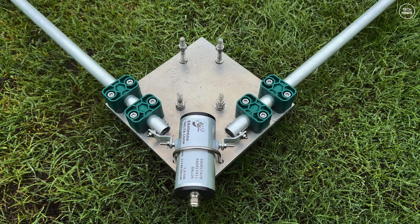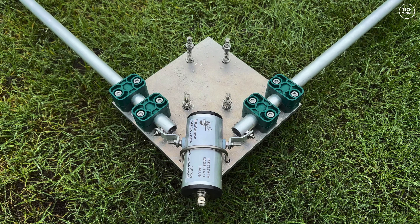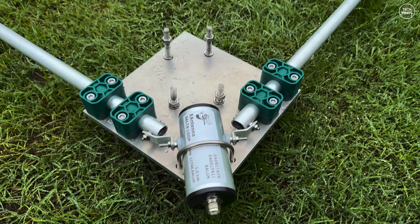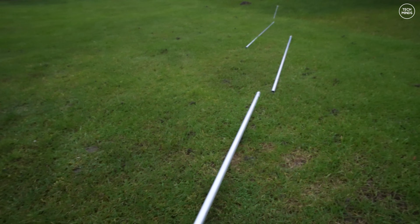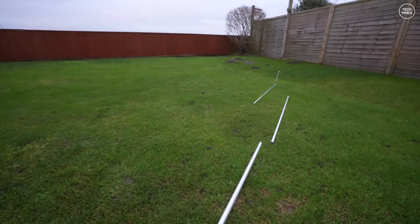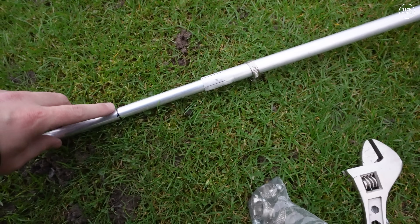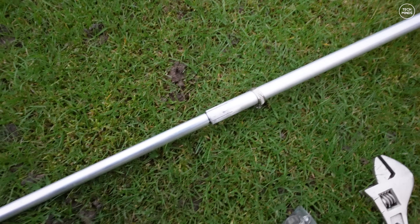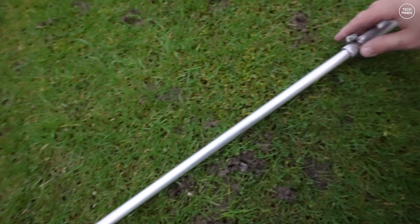The hub is now made with the balun at the bottom and the connection points. It was slightly different to the manual but I think it'll be fine. On the underside I've also attached the brackets we'll use to connect to the pole. The next step is to attach these elements together using the hose clamps. All of these aluminium parts have a mark on them — you only need to go to that mark, then bring the hose clamp up and tighten it, and that section is ready.